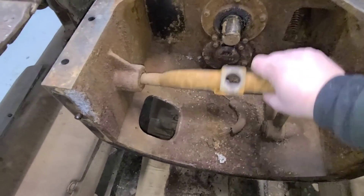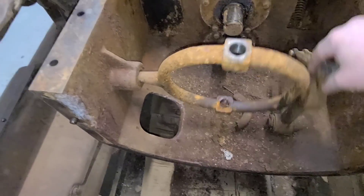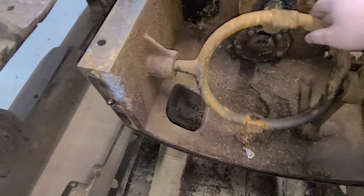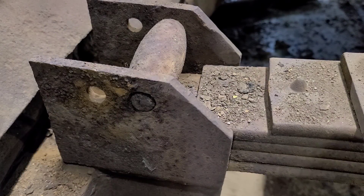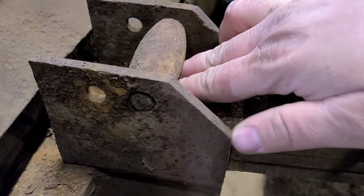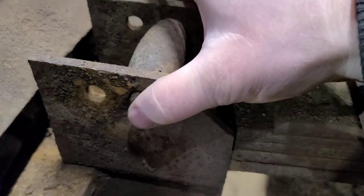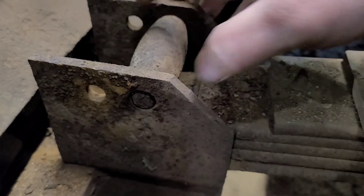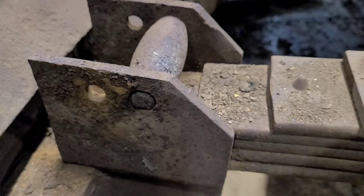More good news — free moving parts. That'll make life a lot easier getting this apart. I think the next thing we're going to do is just try to get this main spring out of here. I tried going side to side with it, but with these rollers here it just will not fit. And these pins do not drive out of this roller. We're going to throw a little heat to that, get a punch in there, drive it out.